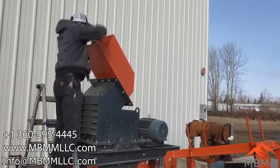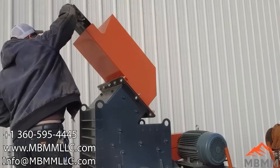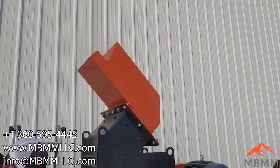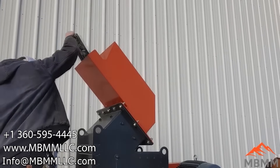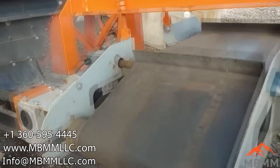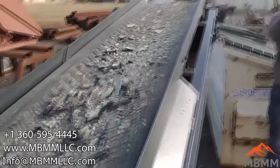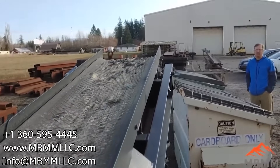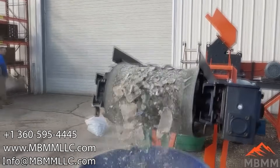I'm going to feed the whole boards into the throat of the hammer mill here. We're going to grind them up with the swinging hammers and we have a one inch slotted screen. All that material is going to come out the bottom and go up this conveyor belt, under a cross belt magnet which will pull off the steel. We're going to actually put the steel back into the sample to run through our hammer mill, because there are some precious metals attached to some of the magnetic components.